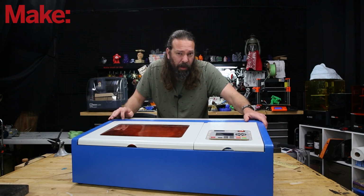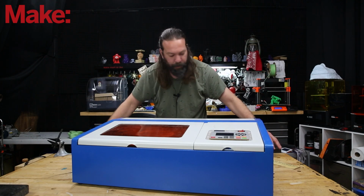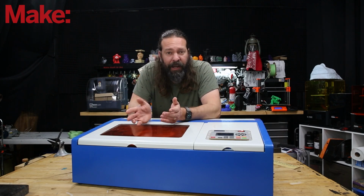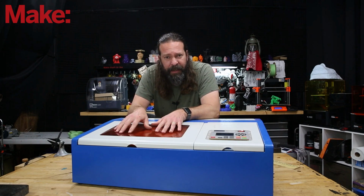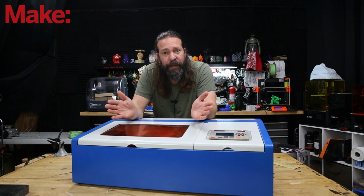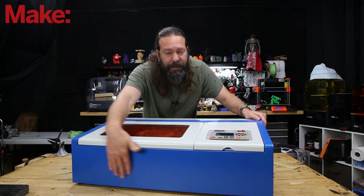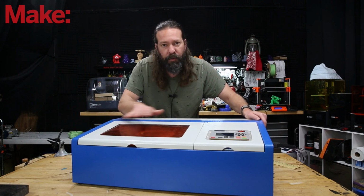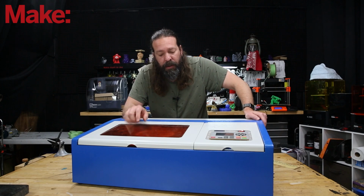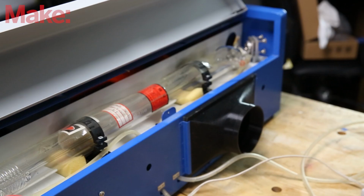And this is actually a small CO2 laser. Once you start going up into bigger ones, it's a much bigger machine, as big as these two workbenches that I have here together. And then the cut area is limited. For example, this one cuts about the size of a sheet of printer paper. For this whole box, that's the biggest it cuts. And this one does not have a pass-through. So you cannot put pieces through and move them around and cut different sizes. So you're limited with this machine to only about the size of a sheet of paper.